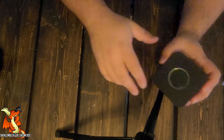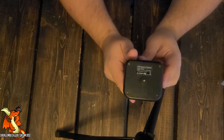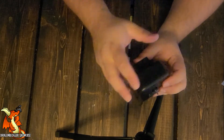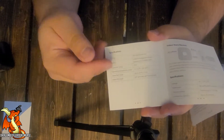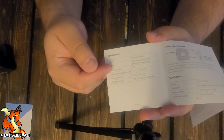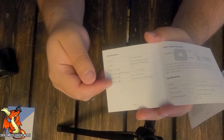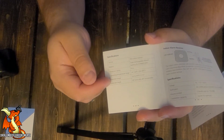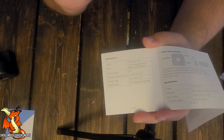Alright. The next thing to do is to get this installed somewhere. And my original theory about it potentially being in the documentation — we do have an IP55 rating, and it does tell me the detection range is up to 35 feet. The angle is going to be 30 degrees vertically and 60 degrees horizontally. So that's good to know when trying to pick out where you install.